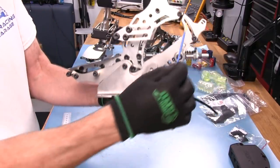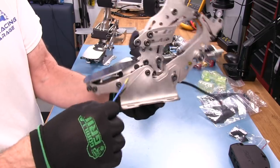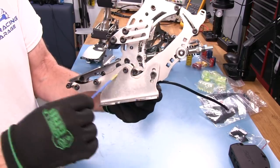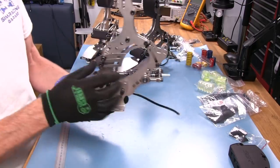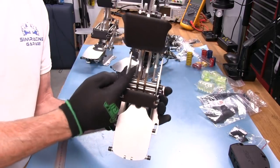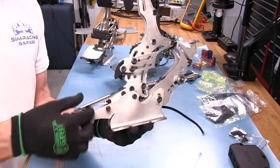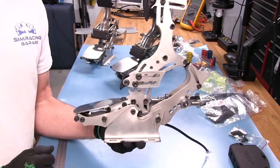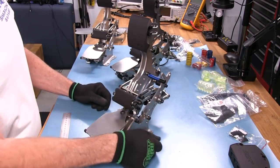And then another major piece is this one here, also 4mm thick, that goes down on the other side, or the inside, of our flange here and all the way to the front. So two massive assemblies there, and then everything else, like these adjustment plates, are 3mm. The only thing less than 3mm is one piece, and that's the plate right here. It's 1.5. And again, all stainless steel construction. A magnet won't stick to anything but the bolts.